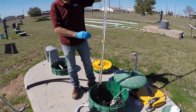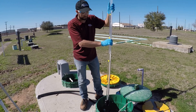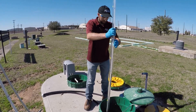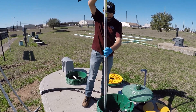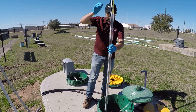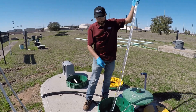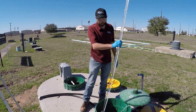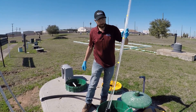Occasionally you might get a couple of inches toward the bottom of the tank — that's relatively normal — but again, what we want to see is just nice, clear liquid in our pump tank, so very minimal solids or no solids at all. This is a sludge sampling device. It has a little ball valve on the bottom that I'm able to control from a rod at the top. This is what we use to see the profile of our tanks.